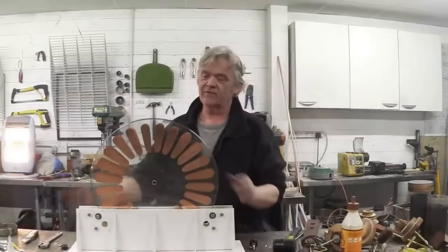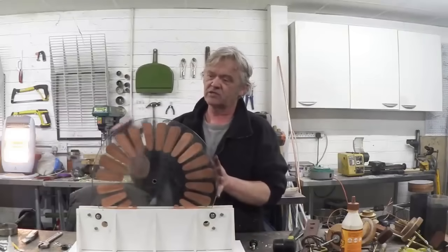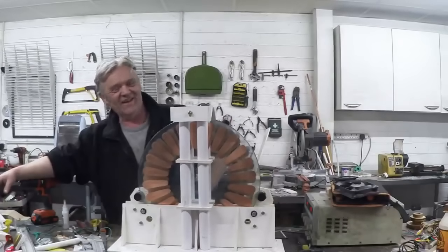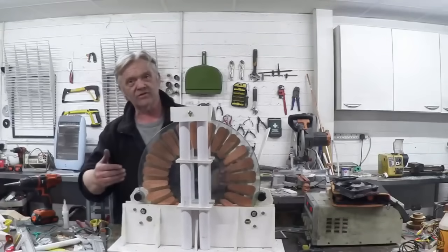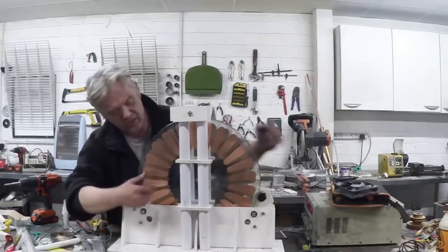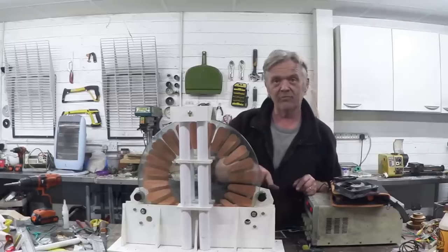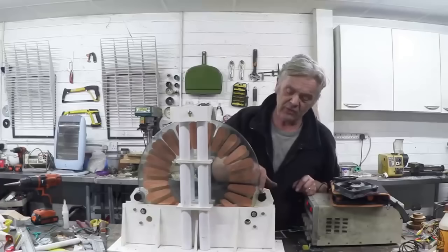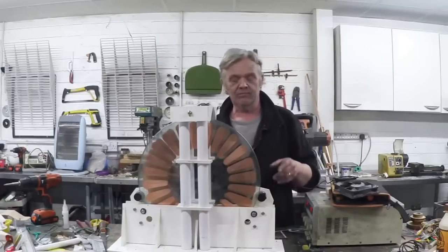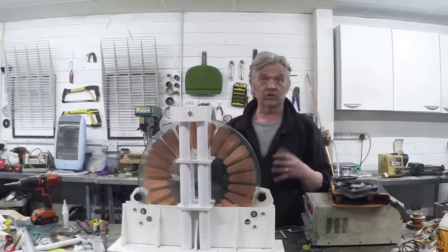The cradle is finished and we've slotted the glass in. The glass is clearly a bit wobbly, so we've built out the frame to correct that wobble using an additional pulley section at the top made from 36mm waste pipe, which keeps everything close together and in true without needing a central axle. The motors are a friction drive using those pulleys with rubber straight against the glass, pressing against it and rotating the wheels — one in each direction — because the positive on one motor connects to negative on the other, so the two motors rotate in opposite directions.